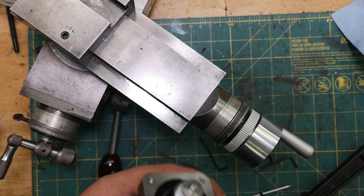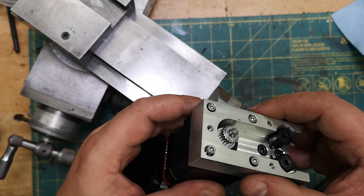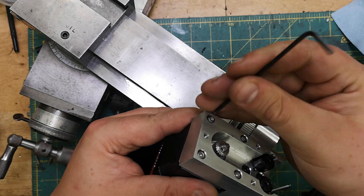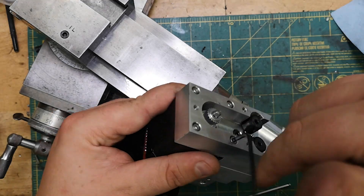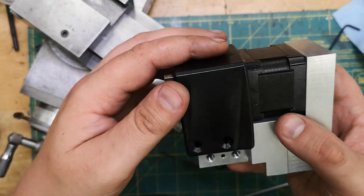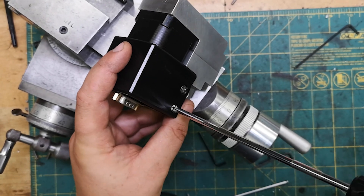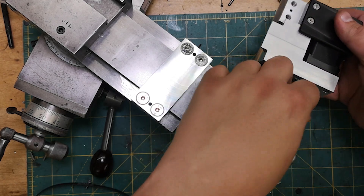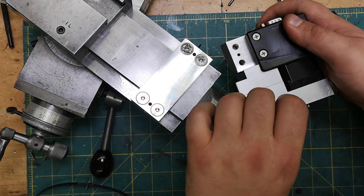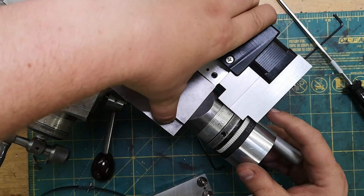Next, I'll be installing the motor, which is the cause for some of the delays I've encountered. It's a closed-loop stepper motor called a Mechaduino, which was a Kickstarter a while back. I had to redesign the electronics a little to avoid using this motor, due to a combination of low availability and catastrophic damage caused by incompetence — we'll go into more detail a little bit later. NEMA 17 motors take M3 screws but permit only a limited threading depth. I'd normally adjust the counterbore depth to accommodate what I have on hand. The rear cover just protects the circuitry on the back of the motor and also gives me a place to mount a DB9 connector — I printed it on my Elegoo Mars 2 SLA printer and sheepishly painted it black. Installing the belt is a bit tricky. Because there's no built-in tension mechanism, I have to position it on the large pulley, hook it onto the small pulley, push it between the idlers, and pivot the motor assembly into place — suffice it to say, this did not all happen on camera.